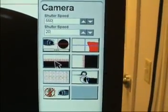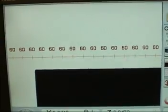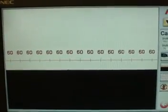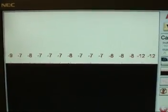Camera alignment. From Presetter Setup, click the Alignment Utility button. The numbers represent the distance of the image to the crosshair of each hash mark. A perfectly aligned camera will have all the numbers match.